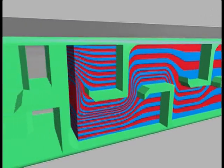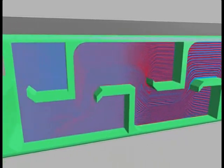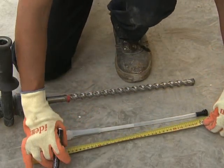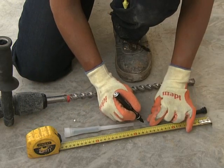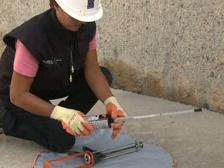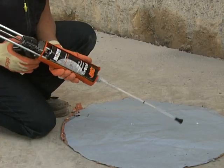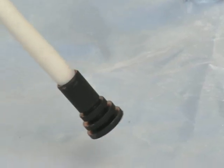The nozzle has a baffle system designed for mixing. If the nozzle is cut, curing is not guaranteed. A marker is placed on the extension tube to identify a point halfway down the hole. The nozzle is fitted onto the cartridge and the cartridge is placed in the applicator gun. The tube is filled with resin so that the first pressure on the trigger expels the mix.